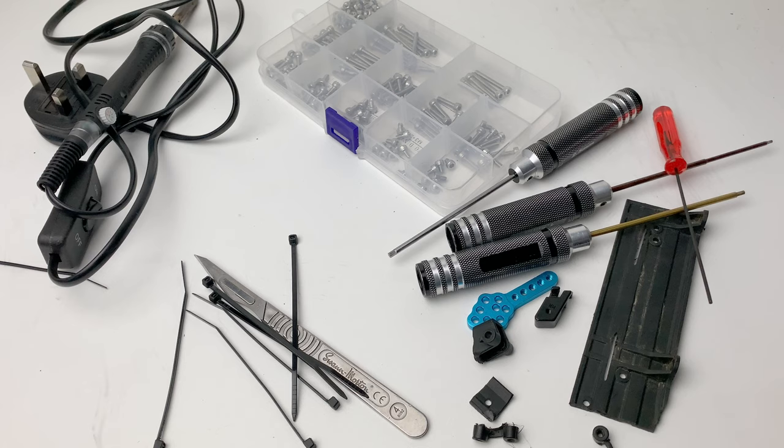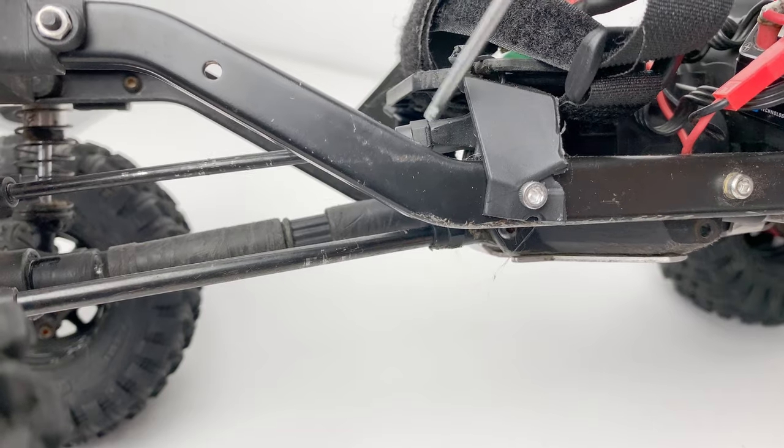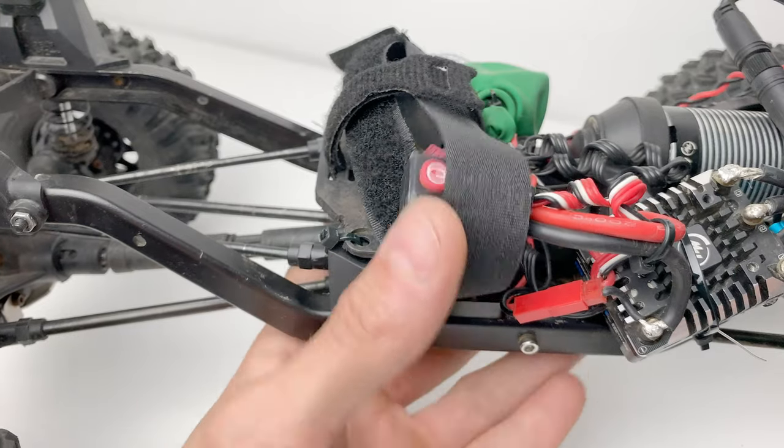The little bits of plastic highlighted are just cut from the tray. You can use those with two bolts to essentially put this link on top of where the existing rear top link mount is and just hold the whole thing in temporarily. However it will wiggle a little bit and not give you the hard mounting you want. If you want it to stay, use the soldering iron to plastic weld it on. Essentially what I've done is messed about with this upper link by plastic welding it a bit higher, which is hidden by this lift.